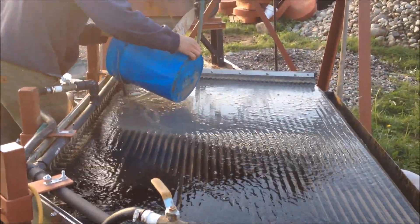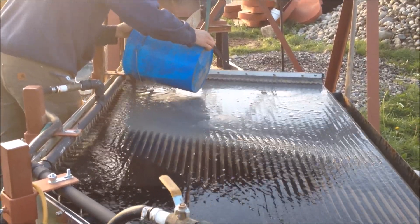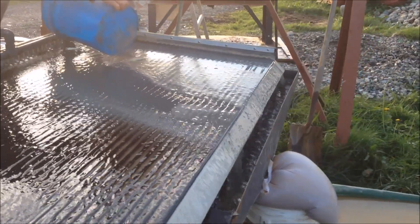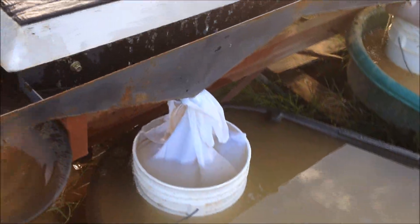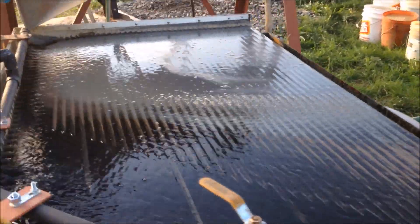This is all really quite fine material — looks like there's a lot of copper in it. We actually have pillowcases on the two discharge troughs to catch all the material. We've got the greenish resin and glass material from printed circuit boards, and some lighter material flowing down here. We're looking for some of the heavier material to come out of these upper grooves and work its way across up to the upper cleaning plane.